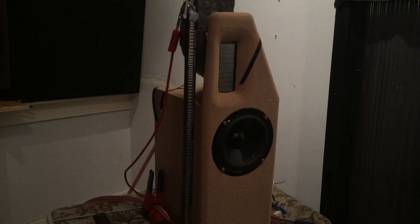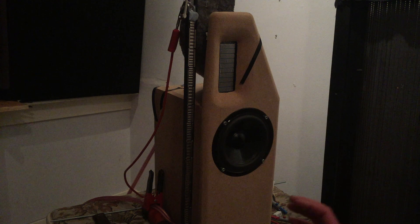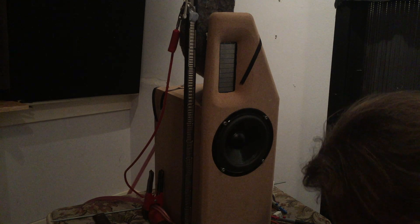It's not perfect — it has distortion. Also, the sides are in a huge magnetic field and the middle is not so much, so I should be using a thinner, smaller foil, which would also improve the impedance. But enough said — let's listen to this insane, crappy-looking thing.